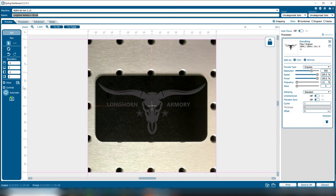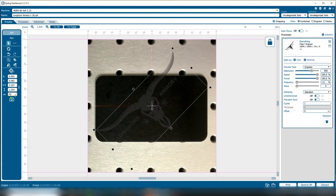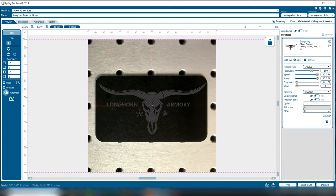All of these functions control the graphic — here's the size of the graphic, the boundary, and we can use rotate functions. If we wanted to rotate that image by 45 degrees, we can do that, and we can change the size of the object as well. Control-Z is always a great tool to back out of whatever you've done. Here you can set the contrast — you can change the contrast for better viewability, especially difficult to see on black substrate like the anodized aluminum we're going to mark. We also have an autofocus feature — you can set the thickness of the material and the Galvo platform will automatically move to that height.